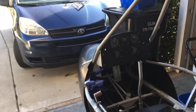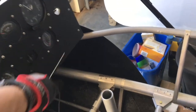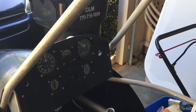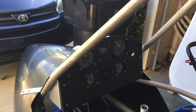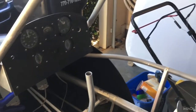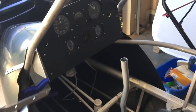I've also ordered some avionics — I'm looking at an ADS-B transponder bundle from Aircraft Spruce. I'll probably cut a hole and put the transponder in here, put the Hobbs meter in the middle below, and maybe put the ELT on the other side. The transponder needs about a 3-amp circuit breaker. I'm not sure where I'm going to mount it yet — maybe up close to me so it'll be near the controller.